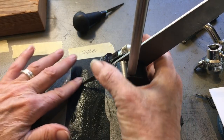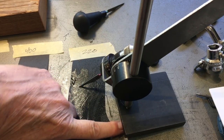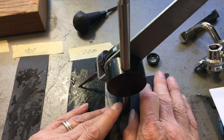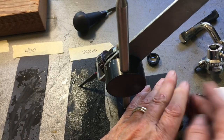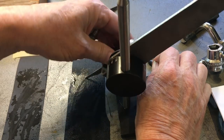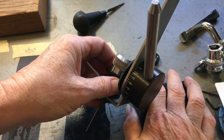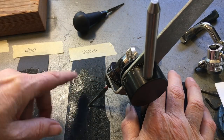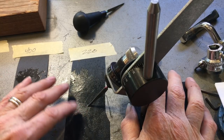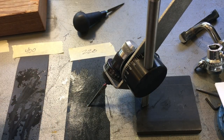I like to start with a 220-grit. I've sprayed water onto my wet-dry sandpaper. I'm holding it with my left hand so I can use my dominant hand to drag across the 220. Depending on how damaged your graver face is will determine how long you have to do this. If the sandpaper starts to get really skunky, you can spray more water on it and wipe with a paper towel — that will take up a lot of the metal dust. The graver face should be smooth and evenly cut when you're done.